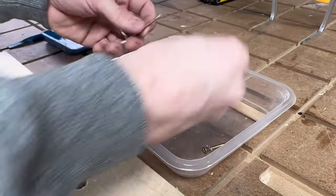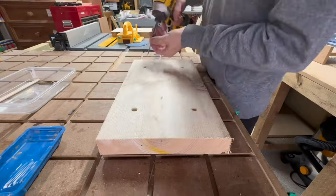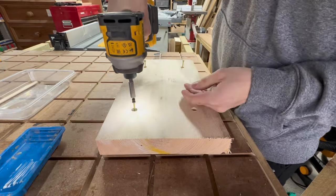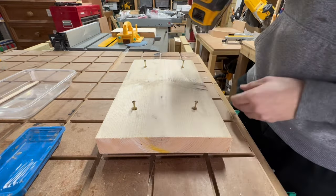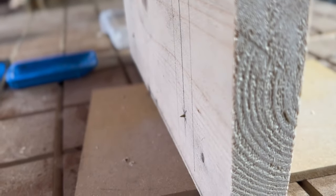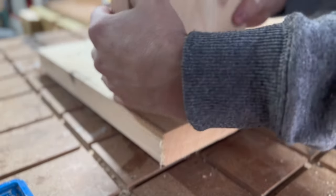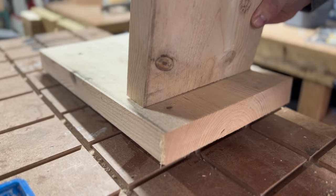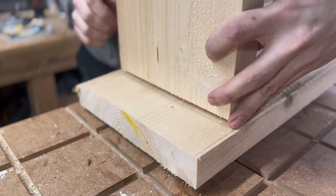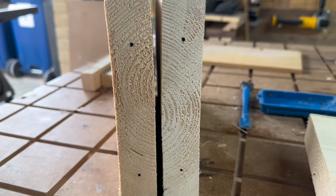Next, I put the 8mm washers onto the screws in preparation for the next stage. Drive your screws back through the timber until they just break out the underside of the seat top — this is a cool trick that's going to save you a bunch of time. The screws should only stick out a really small amount. Now reposition your stool legs onto the underside of the top using the reference marks you drew earlier. Push each leg onto the screws until it sits flush with the stool top — this gives you two marks in the timber showing exactly where the screws need to land. Repeat the process on the second leg. Now use those marks and drill pilot holes straight down into each leg.